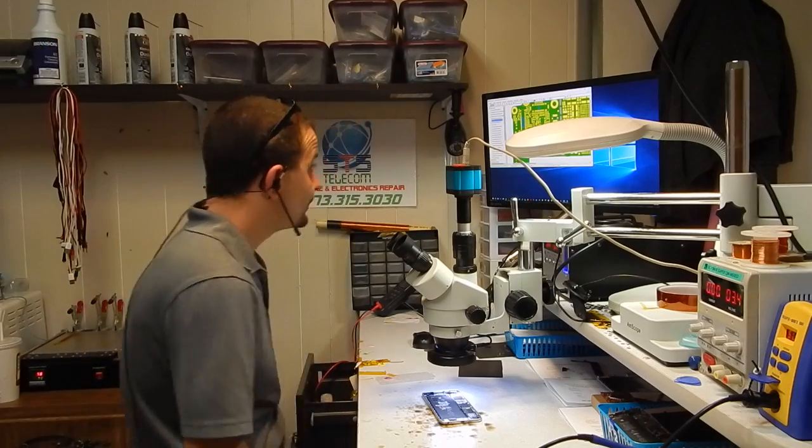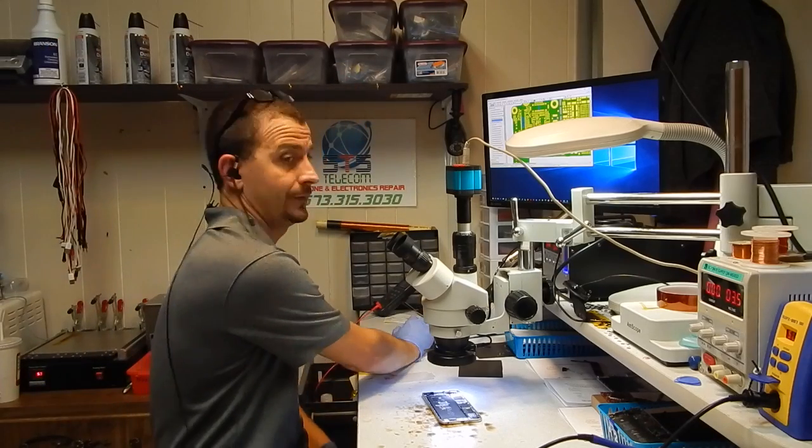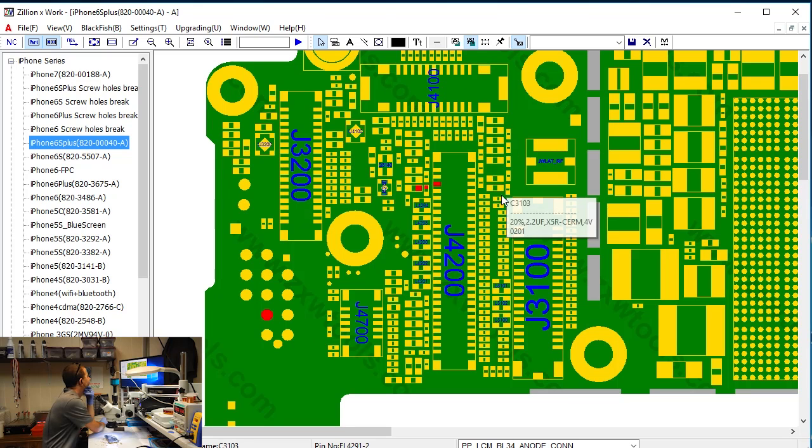Okay, so here's what I'm going to do in this case. We know we have backlight anode over here on pin 3. This one's functioning. We have working anode here. But backlight anode on this pin, now keep in mind this is TP22 right here, backlight anode on this pin is the one that's missing. And it is on test point 25.